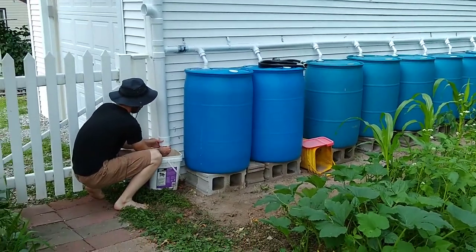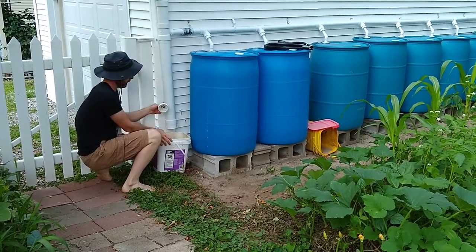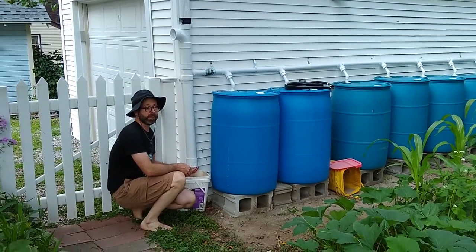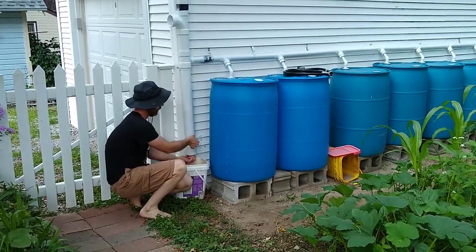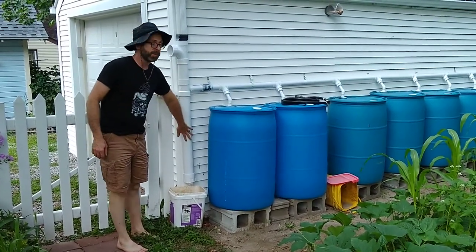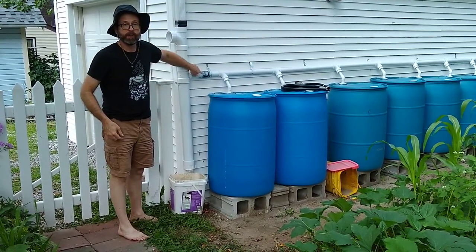The first part of the water goes into the trap, and there's a clean-out at the bottom. I don't actually recommend doing it this way, because when there is water in there and you pull the cap out it goes ka-sploosh all at once and you get dirty water all over yourself. Some sort of other system to let the water out gently would be a good idea — maybe a drain mounted above a smaller spigot to let most of the water out before you open the trap. The point is that dirty water comes in here, and at this tee there is a piece of screen to prevent solid material from going through into the rest of the pipe.